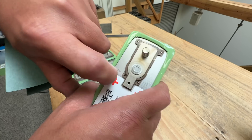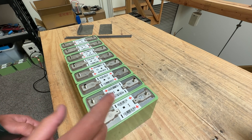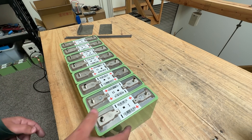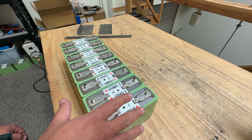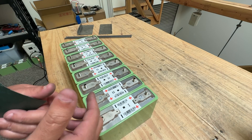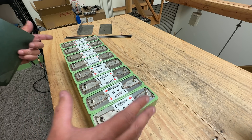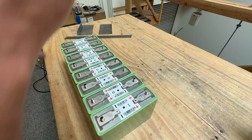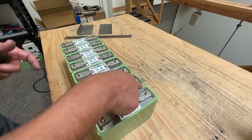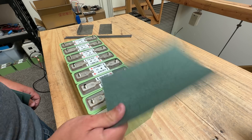The cells have a thin plastic shrink wrap that does the isolation job. But if you're going to put these in a harsh environment — like an automobile or an RV where 24 volts is a perfect use case — you might want an additional barrier between them so they won't chafe or touch. In applications with lots of vibration or temperature swings, things can break down that thin membrane.